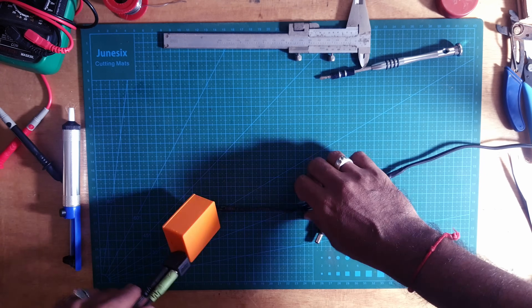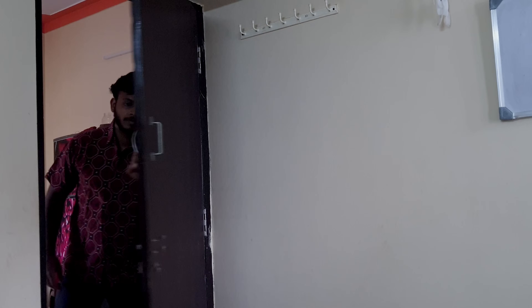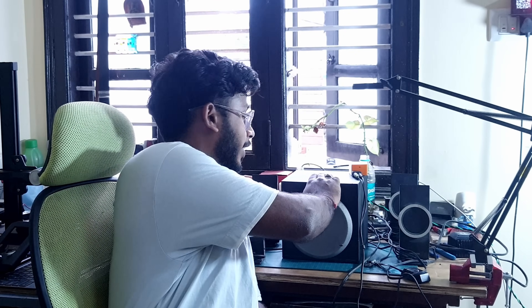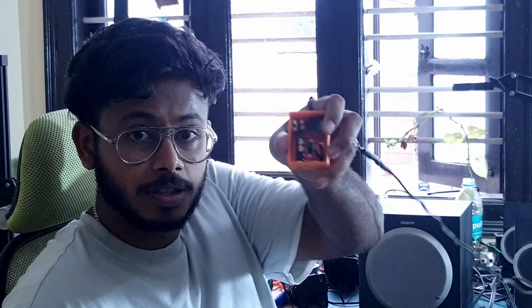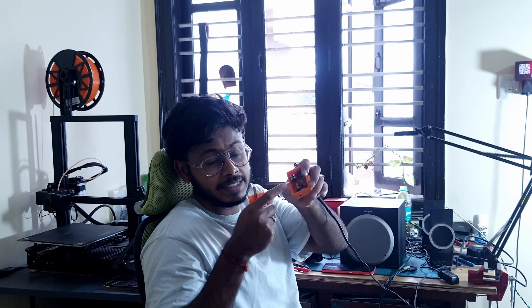The connections are done — let's call our friend and tell him it's ready. Hey, your speaker is ready! This is your regular speaker converted into a Bluetooth speaker. Basically, this contains the Bluetooth receiver board. The 12 volt AC power supply powers the speaker, which is converted to 5 volt DC as input to the Bluetooth receiver board. This receiver board has a 3.5mm jack as output.